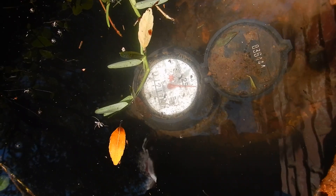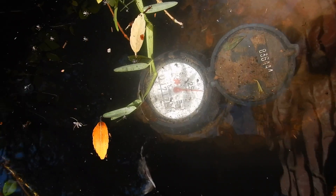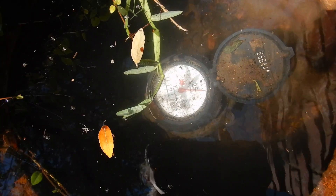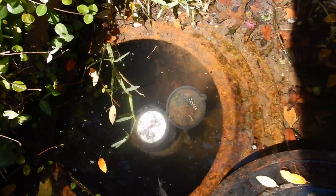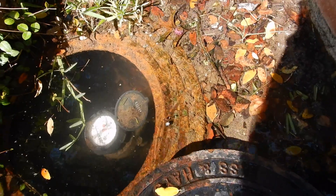Some people call it a cheater wheel or cheater paddle — call it what you will. But it's pretty darn sensitive. And if it's moving, fresh potable water is moving into the house. But someplace we can't find, you still have a leak. This home has failed the water meter test.